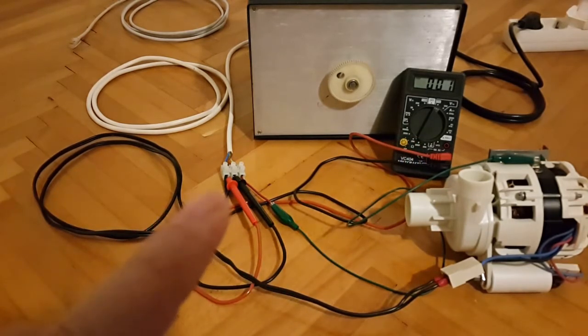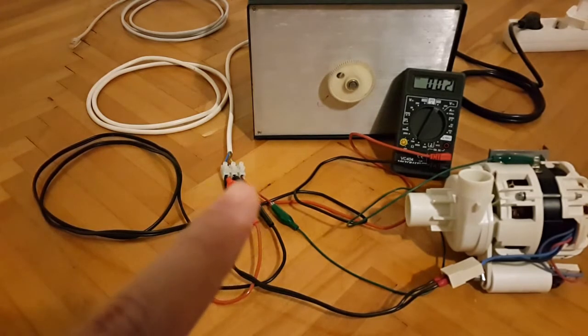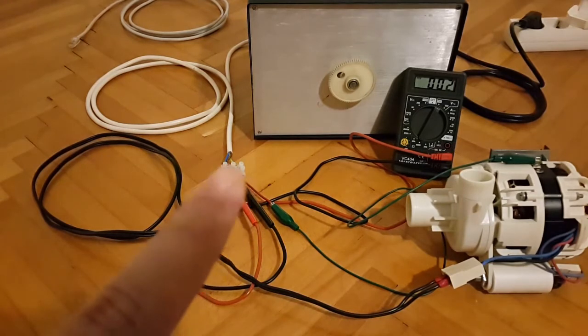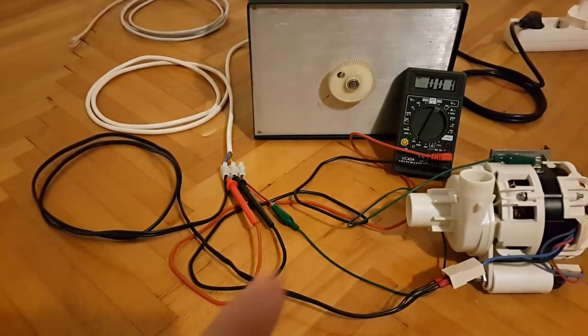And then finally, the 2-strand cable has also been connected into the same holes as the test probe leads are inserted, and then through these 2 special connectors it has been connected to this socket in which the other side of the couplings of the motor are located. And finally, the ground wire via this cable has also been connected to this small latch or leg on the metal case of the induction motor. I'll probably just zoom in a little bit on this part and here and here so that you'll see that everything is connected as it should be. Then we'll start turning this gear or improvised knob clockwise to see when this motor starts to turn.